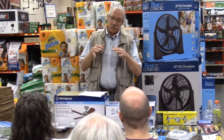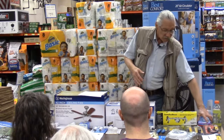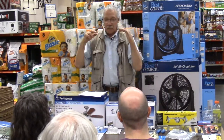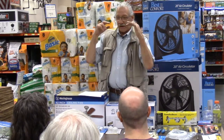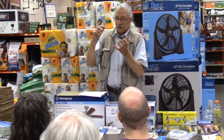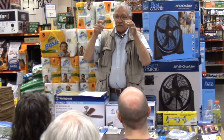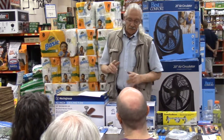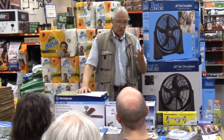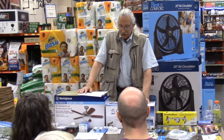All right, so as you put that bracket up to the box itself, you want to make sure that bracket is tight to the ceiling. They usually come with rubber mounts also, so it can't turn when somebody turns the ceiling fan on. There's a little torque usually. Those rubber pads prevent that, but in order to prevent that, it has to be tight. Number one rule for a fan that is moving: make sure that ceiling fan bracket is tight to the ceiling.